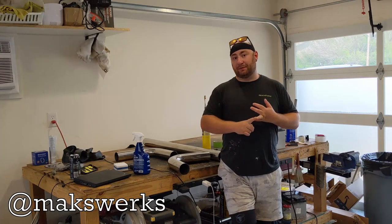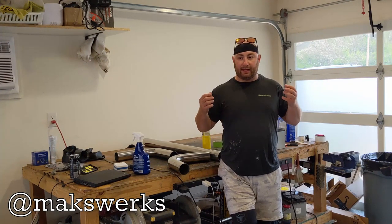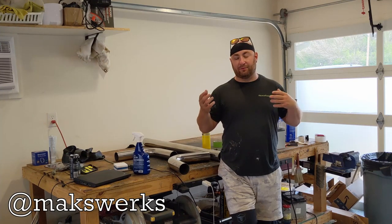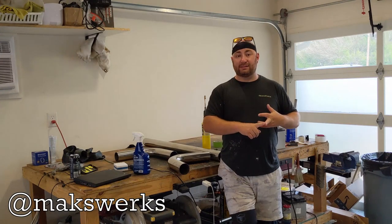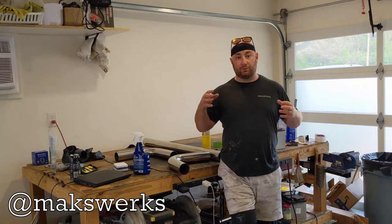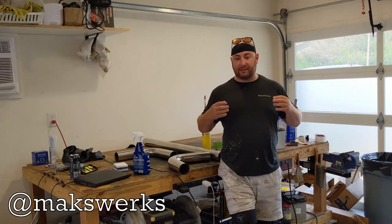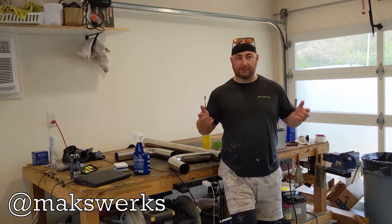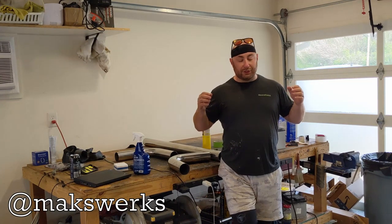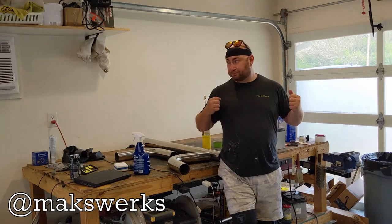Number two is building the surf pipe itself. It's not particularly difficult, but the fit and finish definitely reflects how much time you put into it. And number three is we need to brace it to the boat. It's under a lot of force. Water can really transfer a lot of energy. And so you want this thing to be very secure to the back of the boat because you don't want it falling off in the lake because it can cause you injury problems and you don't want to leave stuff in the lake. So we're just kind of going to work through all three of these steps.